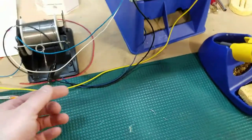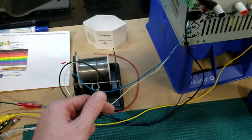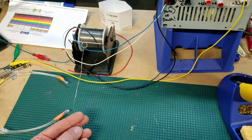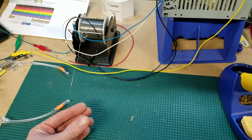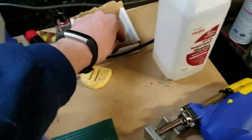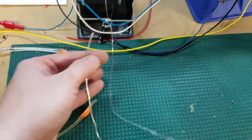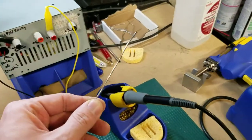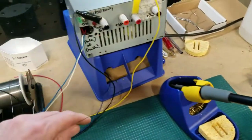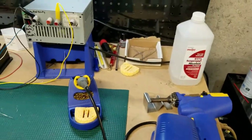I have a couple of different Kester diameters. The smaller diameter is mostly for board work. I also have a larger diameter — if I'm doing work putting coils back on or soldering coil lugs inside a machine, I want a little heavier solder with a little more flux. I keep the remnants of the larger spool here — you can see the difference in diameter. The thicker one is more rigid and I'll carry it with me if I'm doing work on a machine.